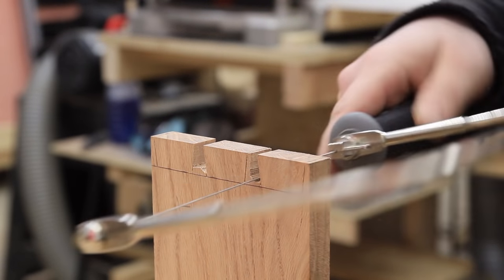And then I can make the first 3 cuts. And I say 3 in this instance because I'm right-handed and I only want to use the right side of the jig. So I can make 1 cut, 2, 3 with this particular setup, and then I will rotate both the jig or the magnetic guide and the board 180 degrees, and then I can still use my right hand saw on the right side of the jig to cut the other 3 cuts.